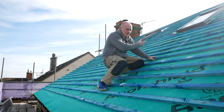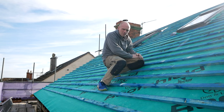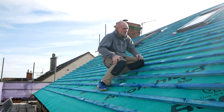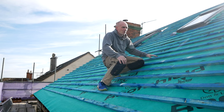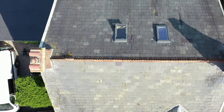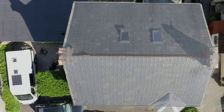We can have ridge ventilation or in-roof tile vents. All those have their problems, one of which is they can quite easily get blocked up with insulation or Christmas decorations. Two, you can get driving rain, driving snow and all sorts causing problems with vents further up the roof. Right, it's going to be far easier if we just peel the roof off, and using some technical wizardry, the guys at Roofshield have come up with this.